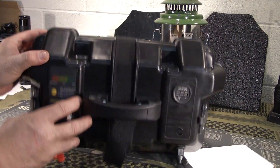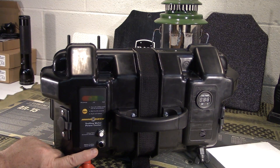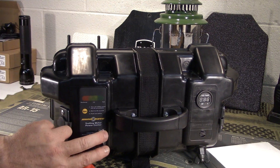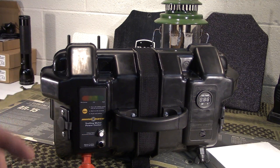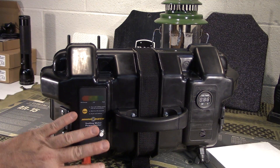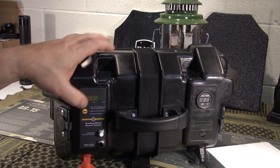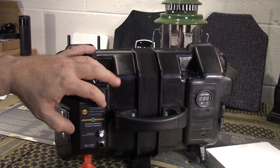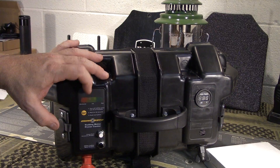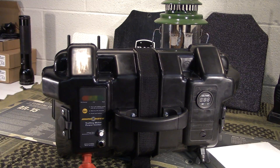It also has two circuit breakers built in — a 60 amp and a 10 amp. I may go around these because my charge controller should be able to monitor and do what these do anyway, so I haven't decided yet. But it also has a built-in battery tester where you just push the button and it'll show you full, half, and recharge, kind of in between that. It's just a push button style.